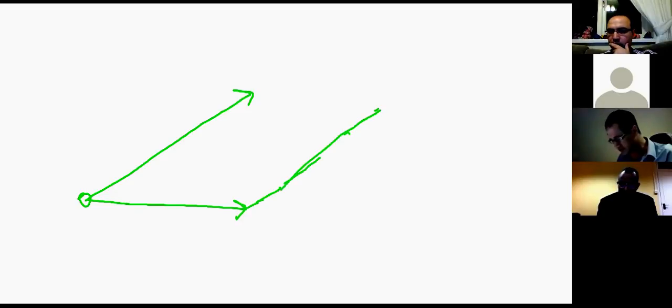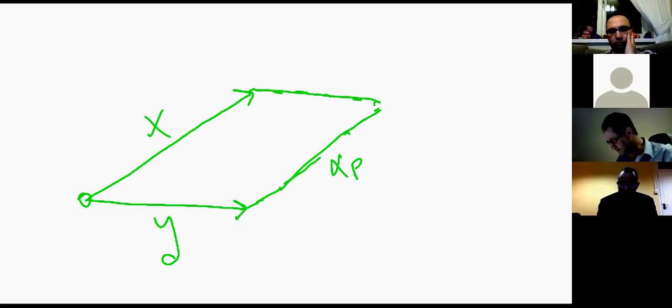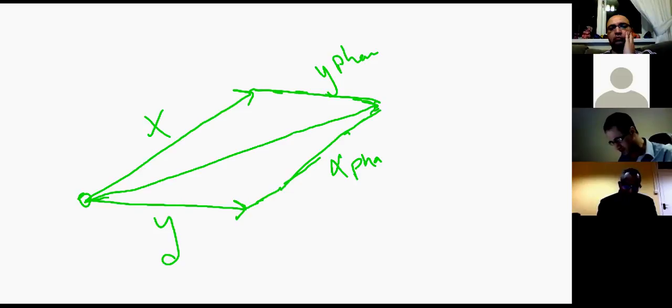there, which is the equivalent of X, and this is Y. And I draw another line parallel, which is Y. Okay, does that make sense? So this is X phantom, for want of a better way of saying it, and Y phantom. What we then have is the sum of these two vectors is in this direction. These two forces are working in this way, and you can appreciate it's quite a large vector. Magnitude is increased, as you can see, and also the force direction is increased.